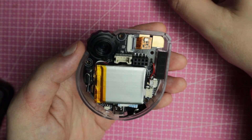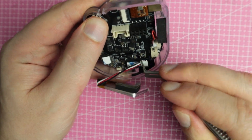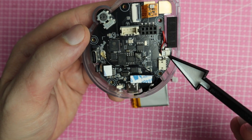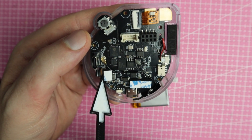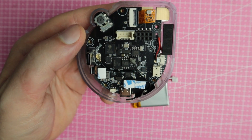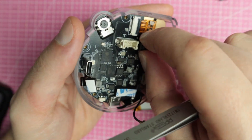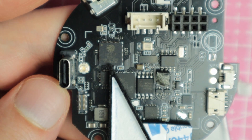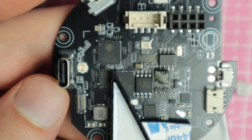After removing five screws on the top cover, we are greeted by a 400 mAh battery. The board also has a connector for a small one-watt speaker, a display ribbon cable, and an IPX connector for an antenna — great if you want to use an external one. Here we can clearly see the ESP32-S3 running at up to 240 MHz with 8 MB of PSRAM.